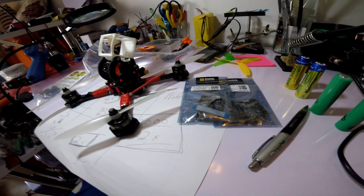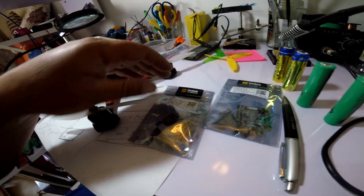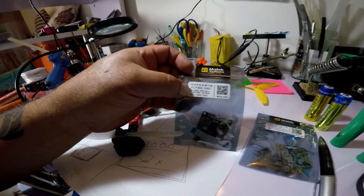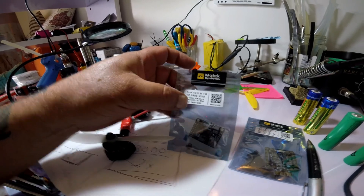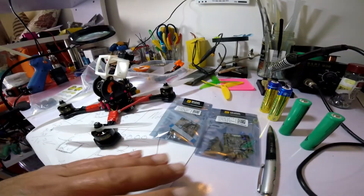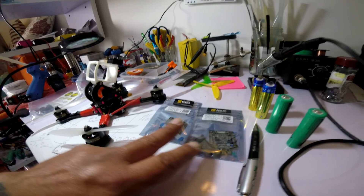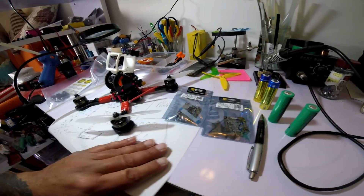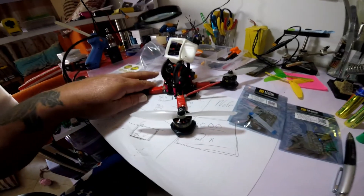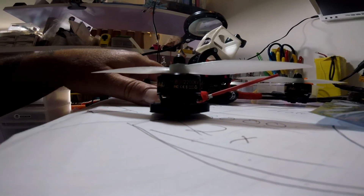When I hooked it up in Betaflight, all the ports and everything were already configured, which was really cool. If you go to the Matek FC F405 page, a whole entire web page comes up with all the details — how to calibrate the current sensor, how to hook it up with the ribbon cable, traditionally or separately. I've never seen anything like it with so much information. No guesswork at all, just straightforward. Anyway, here it is on my six-inch with some beastly F80 2200KV motors.